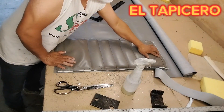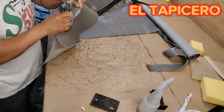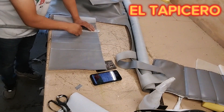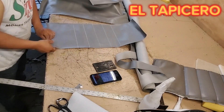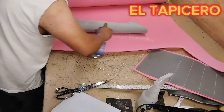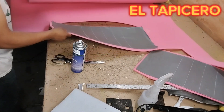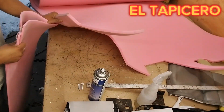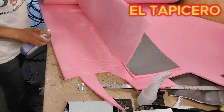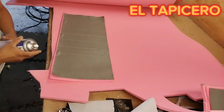In this situation I'm using a ruler to mark a straight line, because that's how it comes from the factory. If we try to copy exactly how the old cover was without a ruler, the job is not going to look nice. I'm choosing a quarter-inch foam layer first, and after that I'm going to put another half-inch foam on top, for a total of three-quarter inch foam.